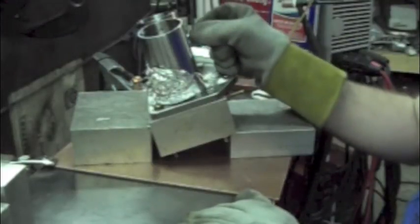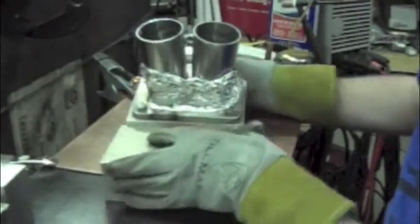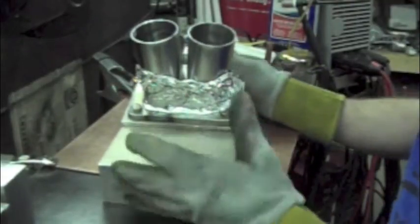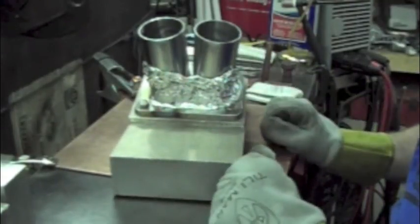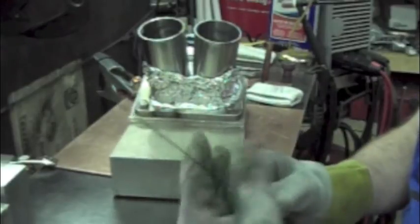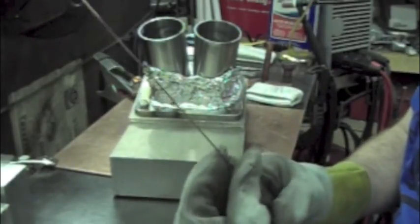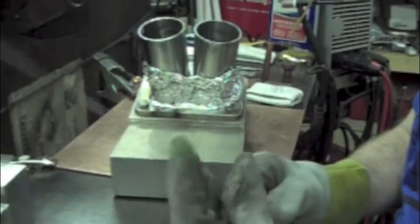Put one hand here, and I'm going to work the torch. One hand here, I'm going to work the filler. And it's right through there, but I gotta kick it at this angle because that's the only angle that I can work with. So that's all you're gonna see. And like I said before, when I do this, I'm gonna use thick. You can run the whole thing on 1/16, no problem. For me, I just prefer the thinner stuff.